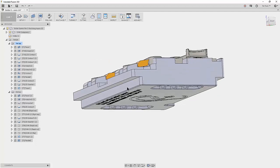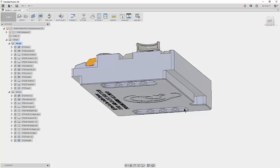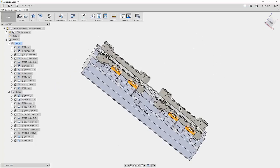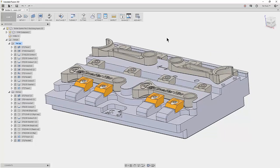It never really made sense to pre-make this side, especially because I like to note what's going on with the fixture — stock size, program numbers for first and second operations. This labeling is a total function of my poor memory. On that note, the vice alignment: anyone who's worked with me knows I'm pretty picky about getting my jaws and vices lined up in the machine. The reason is I want to be able to take a fixture like this in six months, put it back on there, and not worry about it being off.